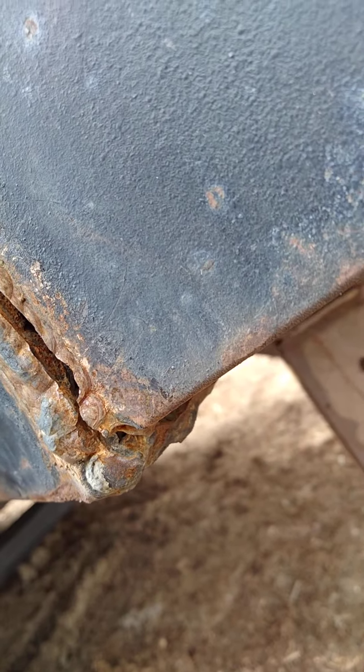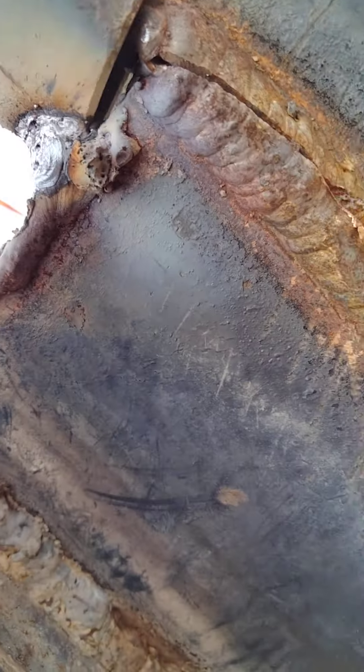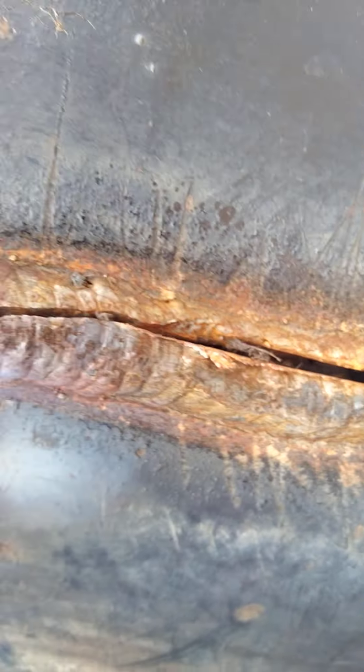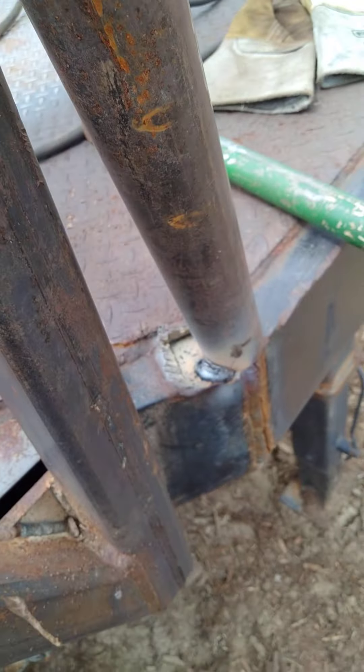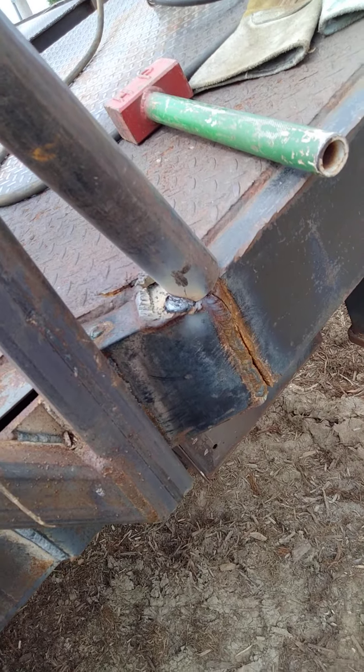Yeah, we were hanging down an inch, now we're hanging down about a quarter. It ain't looking like — we're probably hitting right in there on the top. But that took the majority of it out; probably attempted to cut-off wheel it just a little bit there, but it's damn close. You can see by the weld, it's pretty close. I'll probably just let it fly and stitch it on up. This little trick works great — literally that was hanging down about an inch, inch and a quarter when I started. We're down to a quarter inch, so it's pried up an inch and got us pretty close — close enough for an old ramp to unload train cars.